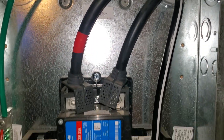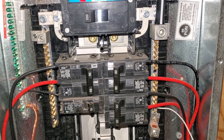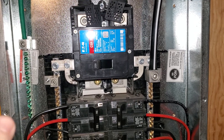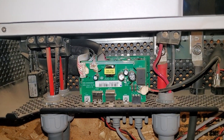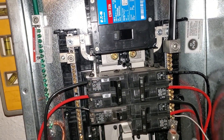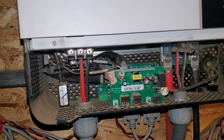That's coming from my meter into this power shed — that comes direct. And you come over here, and this is extremely important: all these are wired with the red and black going to the inverters, and nothing is crossed up. You cannot cross up these phases — they have to be the same on every inverter.